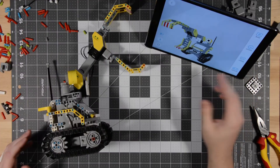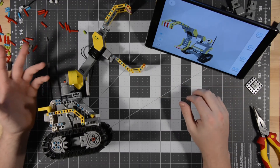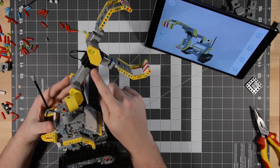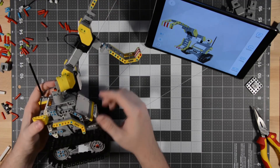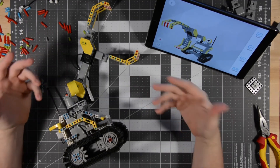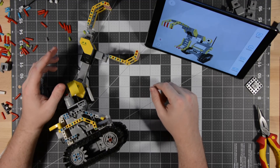What are my final thoughts? Quite honestly, I think it would be good as an educational tool. To get this robot to do anything beyond basic pre-programmed movements like waving or picking something up, you have to program it yourself. To plug it in and hook it up, you need to understand that JST connectors are one-way, and that the servo motors operate in a specific way because they're all ID'd — each block has its own servo motor driver built in, making it a one-wire type system. It seems like a really solid system, and honestly, seeing it work is kind of fun. In another video, I'm going to tear this entire thing down and rebuild it as the DigBot. Let me know your thoughts in the comments, click the thumbs up if you liked this video, subscribe if you like what I do, and have a fantastic day. See ya.